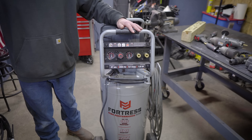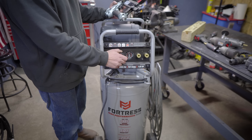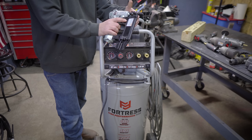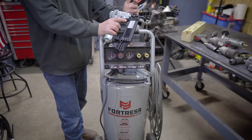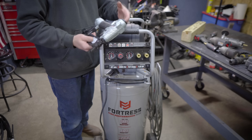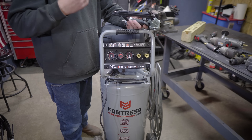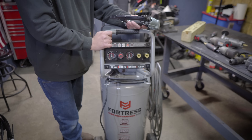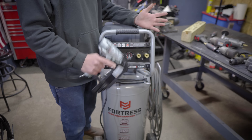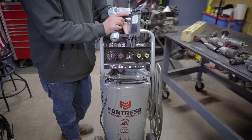I'm going to start off with this little brad nailer. Now let's talk about your outlet psi — you can adjust it with this knob here. On your tool it will tell you a recommended psi. This one has a recommended range of 70 to 120 psi. I'm going to run it at about 90, which is normally what you'd run most basic air tools at. Paint sprayers you'd run at lower psi, but I'm going to run all these tools at about 90. I don't expect this compressor to struggle with this tool — these are really low demand.